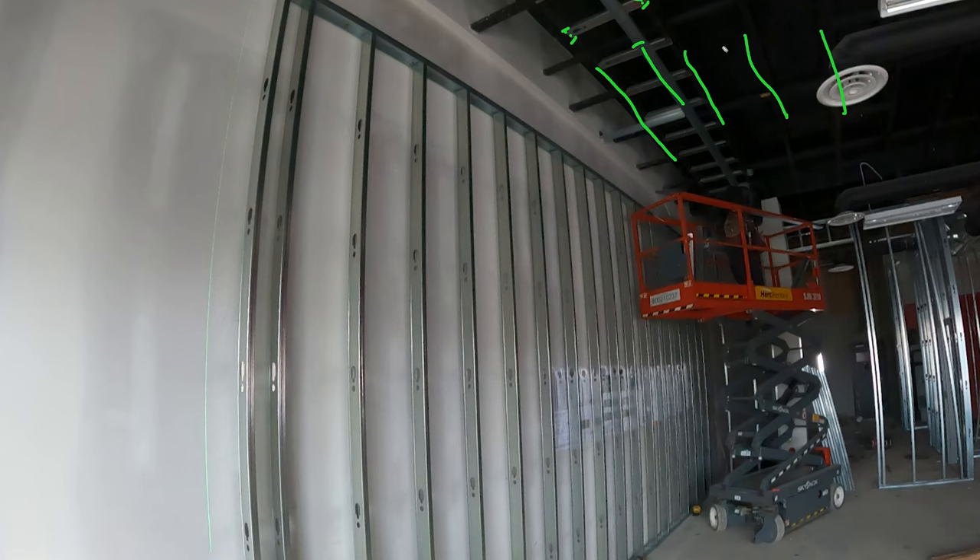It's all black roof so it's hard to see the wood trusses, but trust me they're there. He's now installing the top track. You've got line lasers everywhere, but you can do this with even just one line laser. Make ticks on the studs — that speeds up the process when hanging track, because sometimes your body gets in the way of the laser. Also, the track can bend and split the beam, so if you just mark the center of the laser line, clamp your top track right on the mark, and screw it in — done. He's marking his 16-inch centers as he goes.